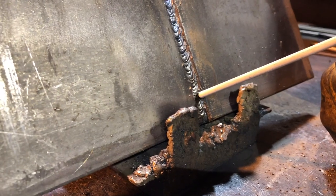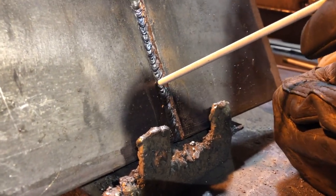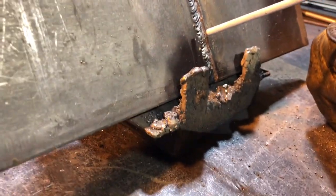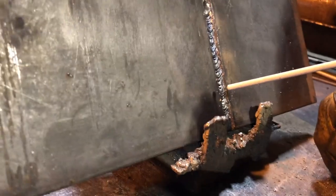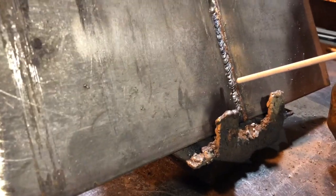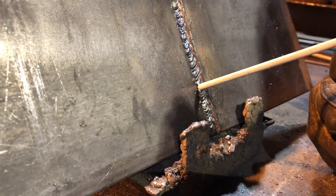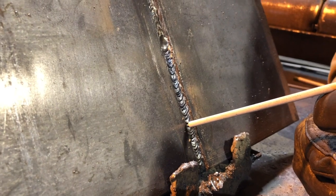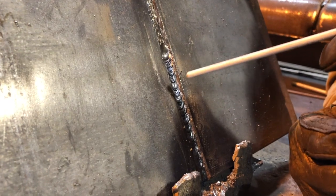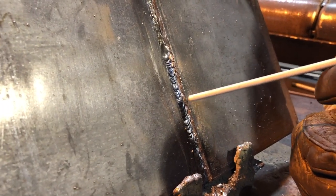I train a lot of people — I have a lot of students. When I finally get them to realize where the weld pool is and they're looking down below the rod, then they start manipulating the rod correctly on travel speed. I see a lot of people who go diagonally up quite a bit — that Christmas tree shape — and then you have inclusions and voids. There's undercut and there's underfill. What I found out with the rods: when you first go over to the side, the first second it just carves, and the second second it fills. You need to stay long enough on the sides so what you carved out first gets filled back in. If you move too fast and don't stay long enough on each side, you get problems. Some rods penetrate pretty hard — if you run too cold on an eighth-inch 7018 and turn it up, it forces itself into the material better. Short, steady arc. As soon as you long arc, gravity takes hold of that liquid weld pool and runs it downhill.